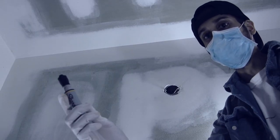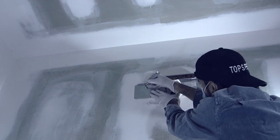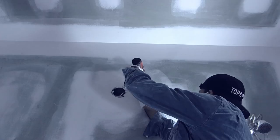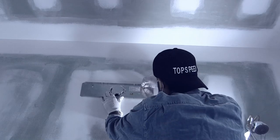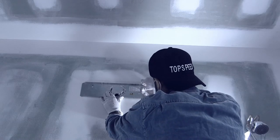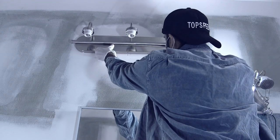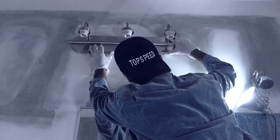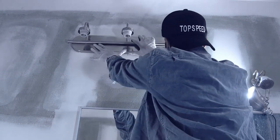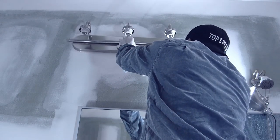Use your leveler and your marker. Check to see if your mounting brace is level, and then mark off the holes where they meet the drywall. Take your drill and drill some holes where you marked off. Now screw in the mounting screws. Attach the fixture to the mount to make sure it's level and that it's nicely lined up with the medicine cabinet. Since the light fixture needs to move over to the left a little, we need to make new holes in the mounting bracket.